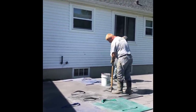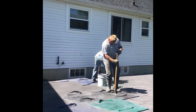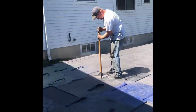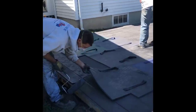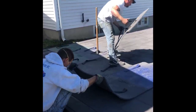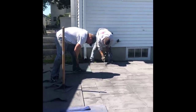You can see we're just slowly working our way to that corner that's in the shade. A lot of times if it's all in the sun, you don't have that much time to wait — you just got to go and get it done. There's a small window of time when you're going to get a nice pattern in it, especially if it's in the sun. There's definitely a little bit of a learning curve — if you're thinking of trying this, I would definitely try on something small first. This was around 400 square feet. The most the three of us usually do is probably a thousand square feet at one time, and we're really hustling. We've all been doing stamped concrete for over 20 years. There's no going back and fixing it, so you've got to get it right the first time.